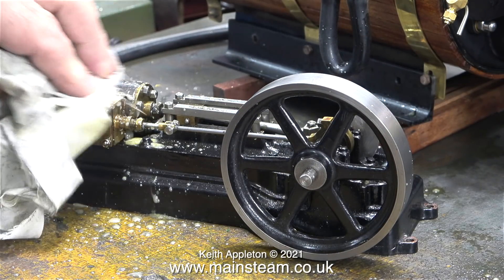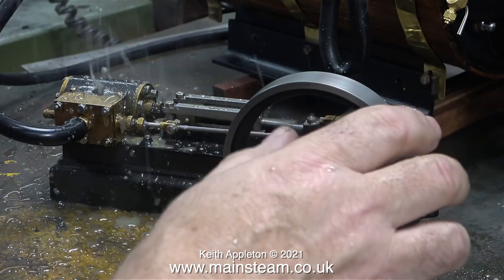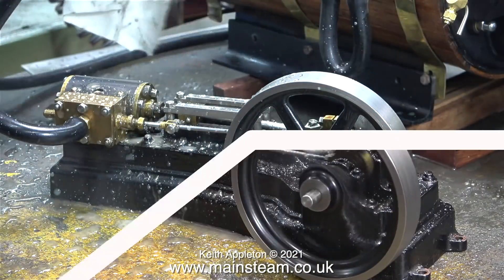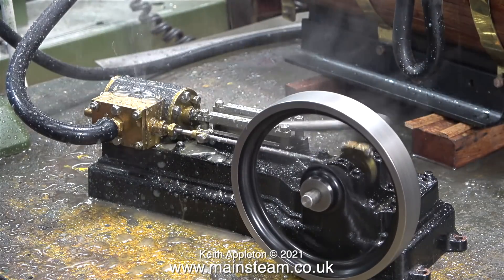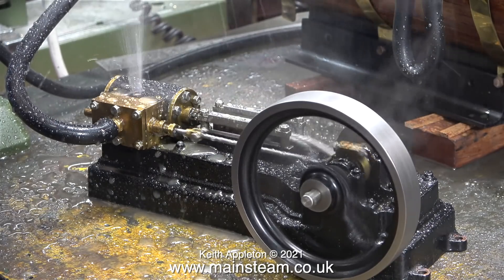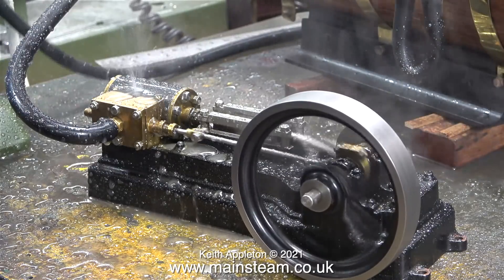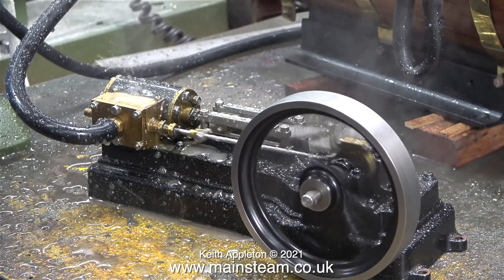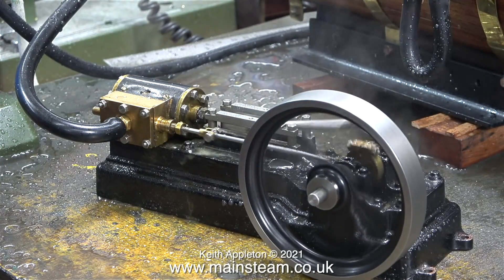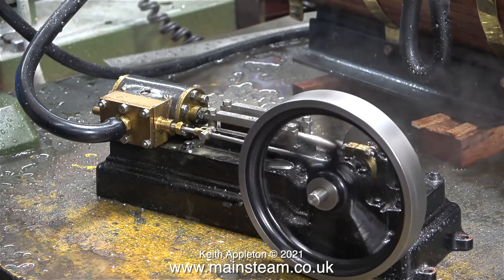It's time for a shower bath! Luckily I knew this was going to happen so I moved out of the way. The usual thing is happening — the cylinder is cold, the steam is condensing into water, and these are steam engines, not water engines. In the steam plant I'm building, both engines are going to be directly piped to an exhaust condenser, which will take care of the condensed water. Very soon steam starts to come out of the exhaust with much less water in it, and the engine runs beautifully.